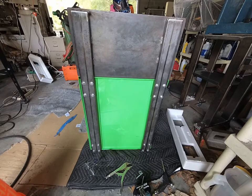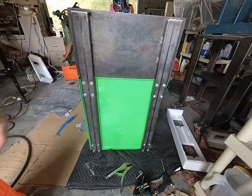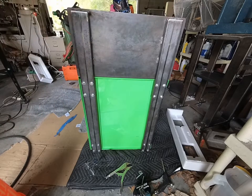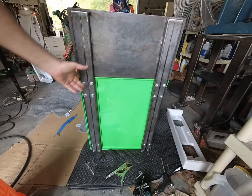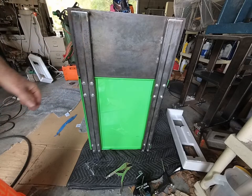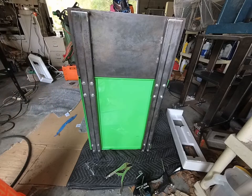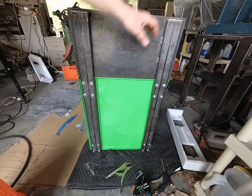It fits. I opened up these holes pretty good, and I had to take a tap and go in and out of the screw holes on the actual box. I welded caps on the ends of these tubes, and that caught all the chips when I drilled these holes — I had chips inside the tubes that caught on the bolts and gummed up the threads. So I had to take a tap and ream everything out, then take tiny pliers and pull all the chips out. If you decide to do one of these things yourself and you want to put pretty caps on the ends of your tubes, put the caps on after you drill the holes.